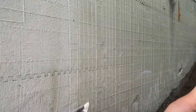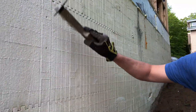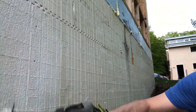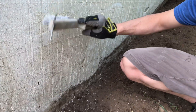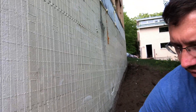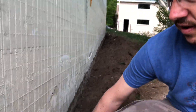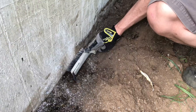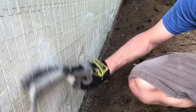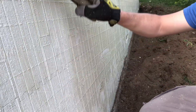The first step is you've got to wire brush the styrofoam — it's been sitting in the sun and generally it's yellowed. You can see I've done this part here. Just wipe it down and you can get any dirt that's on it; it just wipes off. The wire brush works pretty well — you're not trying to make it super rough, just trying to get that yellowing oxidation off. It makes a better bond.